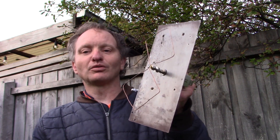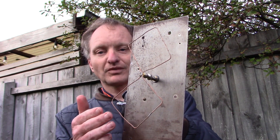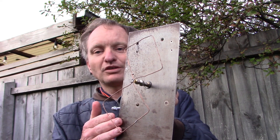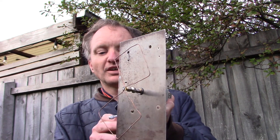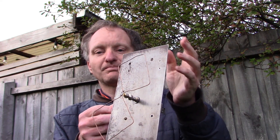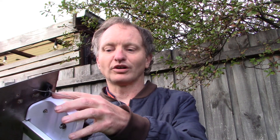This is the new antenna I've built for receiving — I'll give you a bit of a close-up. It's a bi-quad. I'll have the link in the video description. Basically, it's a refined version of the antenna I described in my recent last 23 centimeter video, except a little bit more refined. The other one just used kitchen foil; this one is a bit more permanent. You might enjoy the soap dish there — that's the best I could find in a shop to make a right angle mount.